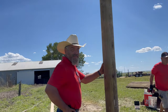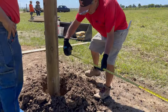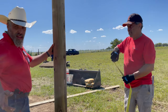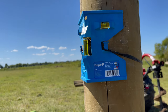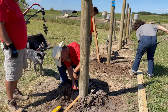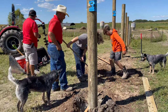A lot of what we're doing is standard laying out fence posts. We want to make sure we've got about 15 foot nine center to center. Traditional lumber — 16 foot is 16 foot one — so if we've gone uphill or downhill, we've got a couple of inches to play with. We got these from a local big box store, recommended by our sales rep. We really liked them — we've got two of them, they weren't expensive. The levels do pop out with pressure and the rubber bands broke, so get some extra rubber bands and be gentle with them.